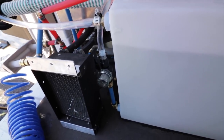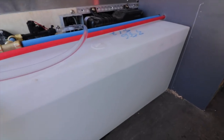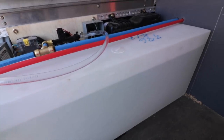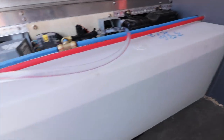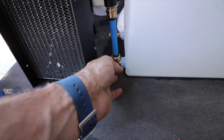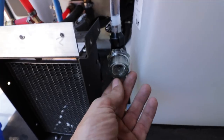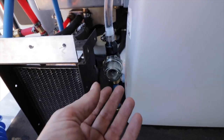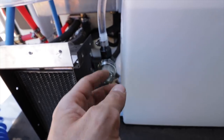Let's start at the beginning. The source of the whole system is the 21-gallon poly tank here - it's only about 8 inches wide, 16 inches tall, and roughly 3 feet long, which comes out to about 21 gallons. It has four outlets on it. The first one comes off the bottom - the 90 goes up, this is the supply - and it goes to a canister-style filter with a screen in it. That will protect against gravel or any contaminants if we needed to fill up from a stream, so it won't destroy the pump.